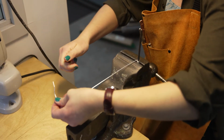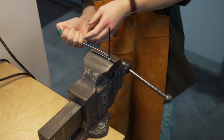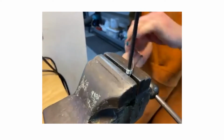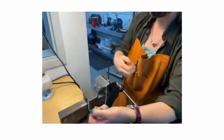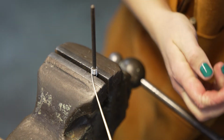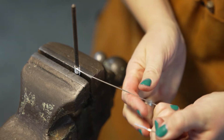It's amazing how malleable the material is. We'll talk more about annealing in a moment, but work hardening is something most people have probably experienced with a paperclip. When you bend a paperclip back and forth and back and forth, it eventually breaks. So you've work hardened it, and it's become harder, but it's also become more brittle, so you can't work with it as well. That process of heating, annealing, gets things back into the right orientation to be malleable and soft again.